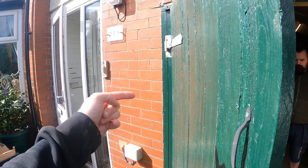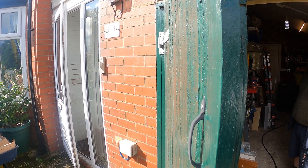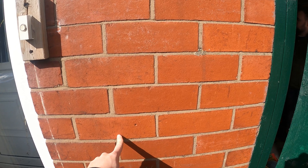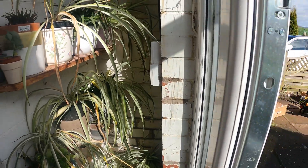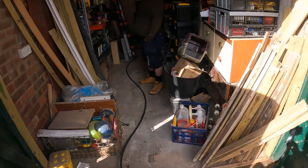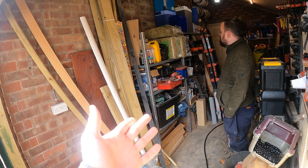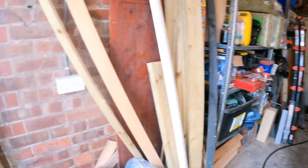Hopefully we can get a drill through there on an angle, but I'm not sure it is quite the distance for a little single brick. We may have to nip into the porch through there first and then back in, because it's on the left-hand side. The charger obviously needs to be in the middle so it looks normal. We're just gonna run this out — clipping it up and across and back down. Let's crack on — get a drill bit big enough for the linear clips, Ryan.